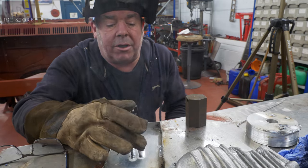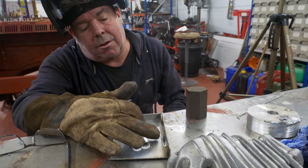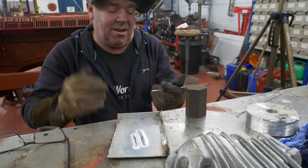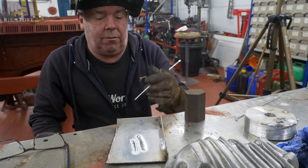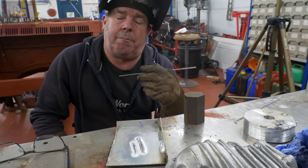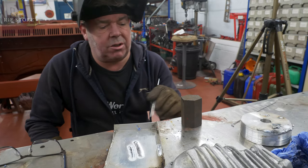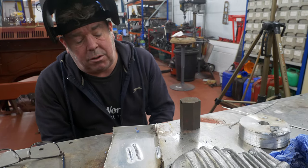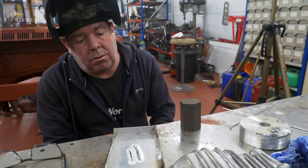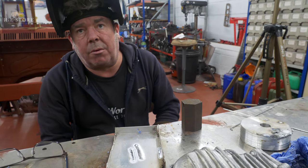See that — holding it a bit too long — that weld's a bit duller. That one's shinier. And it all depends: that's probably completely the wrong rod for that material. If you've matched your material and matched your rod, you'll get better penetration and you don't have to put as much amps into it. There are lots of different combining factors, but basically if you can gas weld with a gas torch or you can braze, you should be able to TIG weld ally.